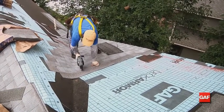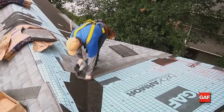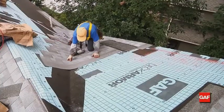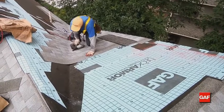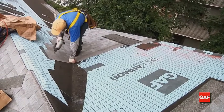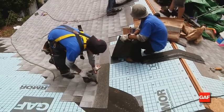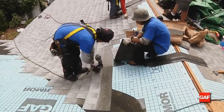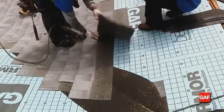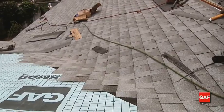Press the shingles tightly into the valley. Make sure that the shingles lay flat enough so that no bridging occurs. Secure the shingles at the valley using normal nailing methods, but remember, make sure there are no nails within 6 inches of the valley line. This will ensure there is a 12-inch minimum nail-free zone in the center of the valley. To ensure proper fastening, 2 nails should be placed at the end of each shingle that crosses the valley. Continue to apply succeeding courses in the same manner.